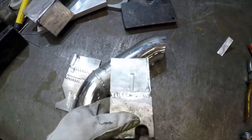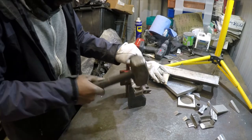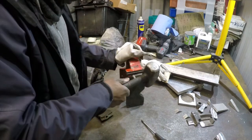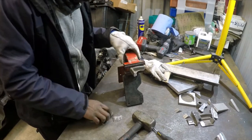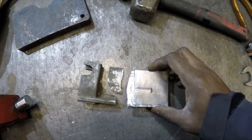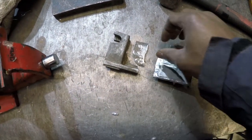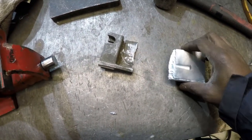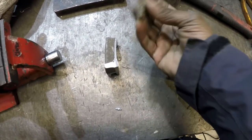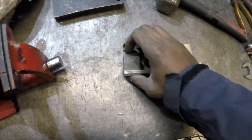Now I'll get the cast aluminium piece in the vice and try to break it. Right — I managed to break it. Good news is it didn't break along the weld; it broke along the actual material edge itself. I used a similar amount of force to snap that bit off the actual casting as well. So I'm relatively happy and confident that the weld is strong. Whether I hit the material itself or the point of the weld, the material will break — not the weld itself. I'm good with that.